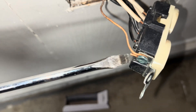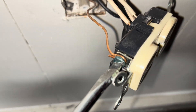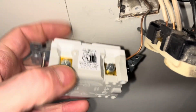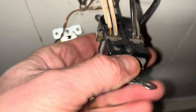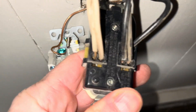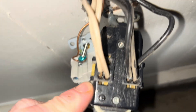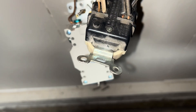Okay, first I'm just going to disconnect this ground wire. Got the ground connected there. Pull the white ones out — white will be silver, black will be on the brass. There's a trick to pulling these out: they don't just pull out. You have to get something to poke down in that little slot right there and it'll release those wires — just like an awl. Push down in that and it'll release the wire.